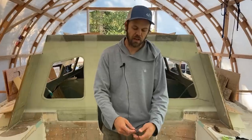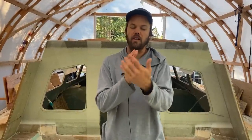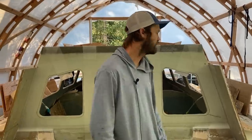Are there a couple voids that need to be fixed? Can they be fixed? Yeah, I need to grind them out because it's a void where the glass is not adhered to the substrate. I know you have to do additional laminations on top of this anyway, so can't those laminations make up for a couple of voids? Yeah, but if there's a void, then everything you're stacking on top of it is not adhered to the substrate either. Right, so you have to fix those voids before you do the next lamination. Mm-hmm. Back to grinding. Yep.